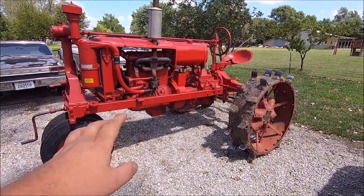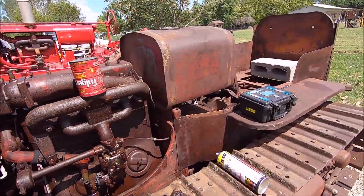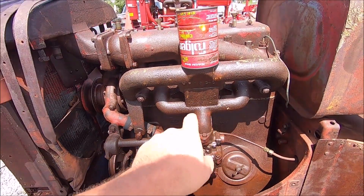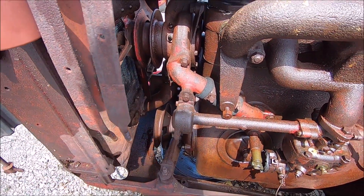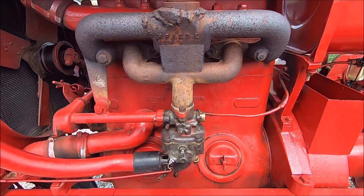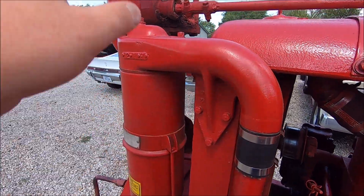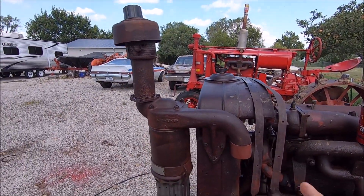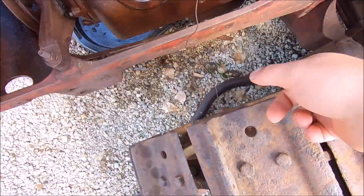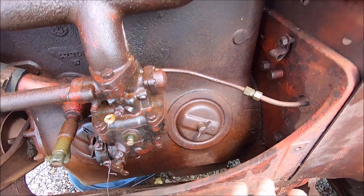I believed everybody on the internet and they said it was the same engine, just this one had a water pump. Well, there's more differences than just that. The T20 uses the same intake/exhaust combo — this has the gas manifold, not the kerosene intake. The carburetor and governor housing are fairly much the same. You can see the same intake/exhaust combo, same Zenith 8099 carburetor, the same intake tube and air cleaner. Now it's only on this particular model that this is all the same — on the earlier one the tube is down there, it's rusted out. But it's the same little engine covers and same basic block.